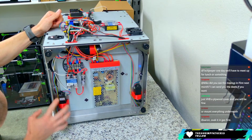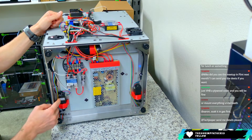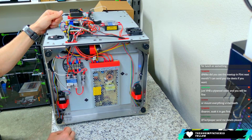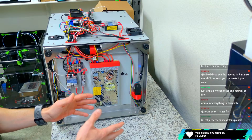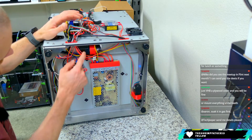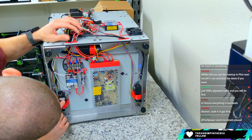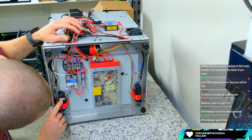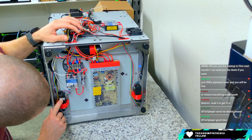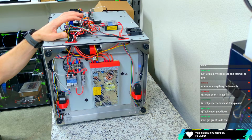But these motors, if you're curious and you want to do this, it is a 3 Z-axis. If you were building like a Micron or maybe something else that is small, like a printer for ants that was Z-drive belted, motors like this I think would work great. These are the 28HS3306A-4XG. It's a 1.8 degree, 0.6 amp NEMA 8.